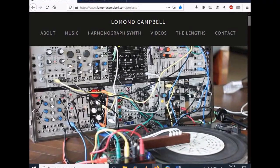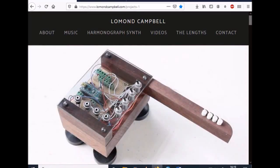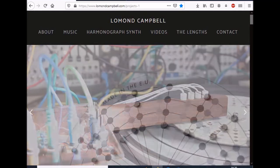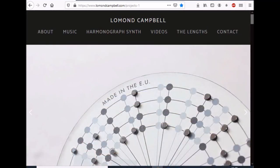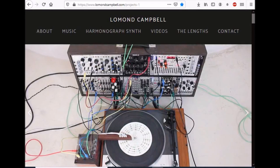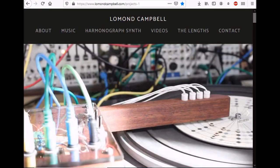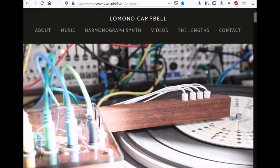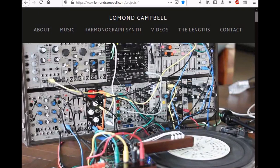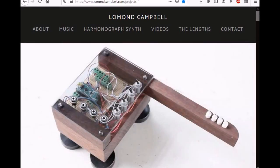And that Arduino circuit then, in response to the triggers that are the magnets, pumps out 5 volts to the different outputs that can then be switched on or off according to the preference. On the turntable, instead of a record, is a metal plate with a paper layer that outlines the patterns for potential rhythms that you can use with magnets. Those magnets are tiny, powerful ones that you can buy, and you simply pop them into position on that metal sheet where you'd like them to go. And as the turntable rotates, the sensors and the reed switches pick up the magnetic field and cause the reed switches to close, triggering whatever you would like.